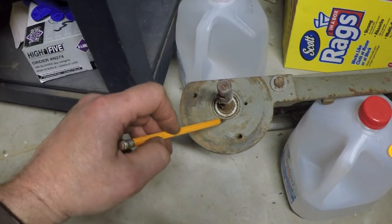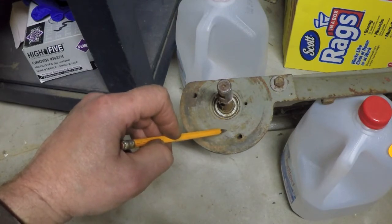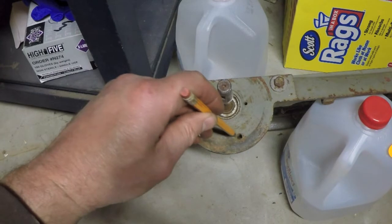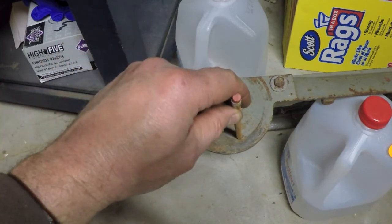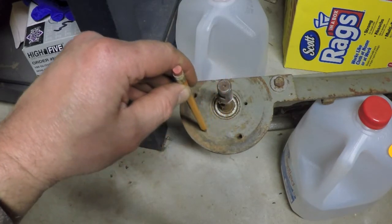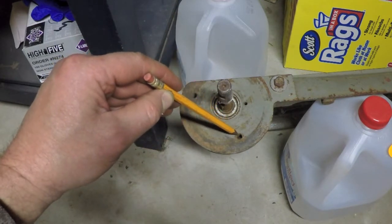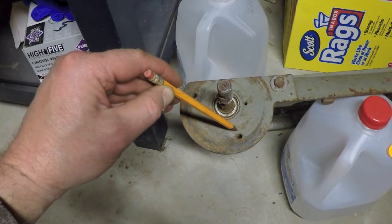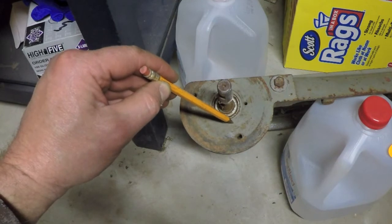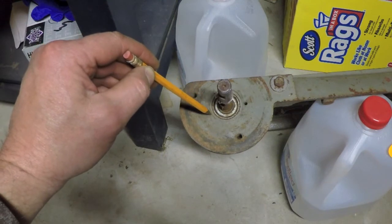inner hole. The difficulty with making this larger is at some point, if I make it too large, I'm going to start impinging on the amount of metal left behind to be on the other side of this slot that's going to go here. So the slot's going to be pretty narrow. That looks like about a 1/4 inch bolt, or 3/8, whatever. So the slot, if the edge of the slot was here, for instance, there's going to be metal from here to here. That should be plenty substantial. So I could probably even go a little bit larger with this hole. But since I don't need to, I guess I won't.